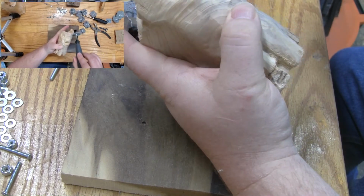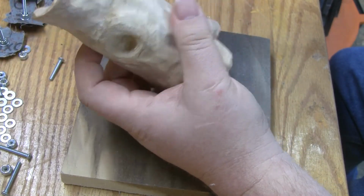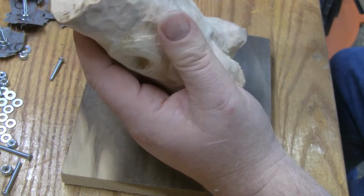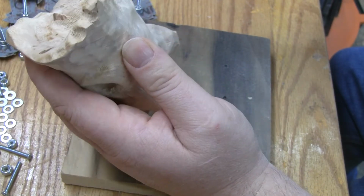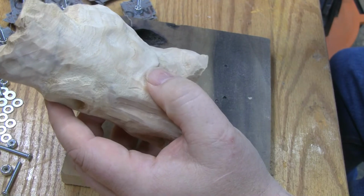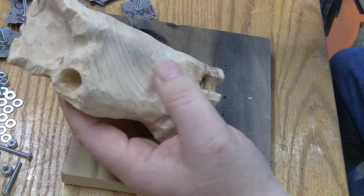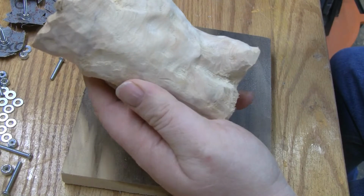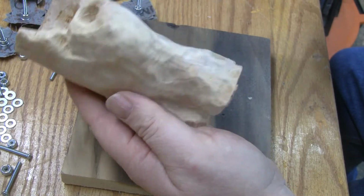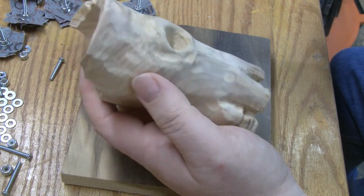Alright, so using a higher grit has saved some of the integrity of the project. Now, I'm not done. Obviously, I can't just say, look, I shouldn't have done that and I'm done. I can carve a little bit more, and you can see how that edge has some character to it. That side has all these indentations, and it's just undulating is the word that seems to come to mind. But see how this side is smoother, and you end up seeing the grain of the wood, which again has a beauty of its own, but it changes what the project is. And so that's the difference between 150 grit and 320 grit. When you're making your sandpaper wheels, you need to make more than one. You can't just do the 150 grit. You've got to get your higher grits in there too.